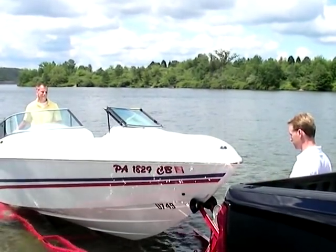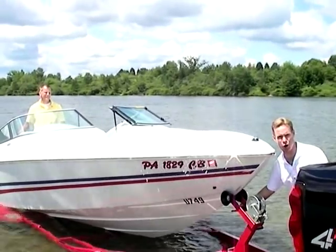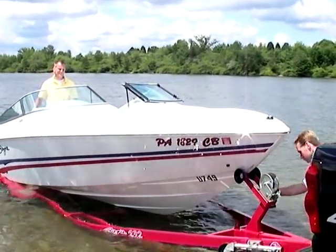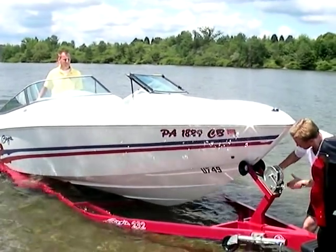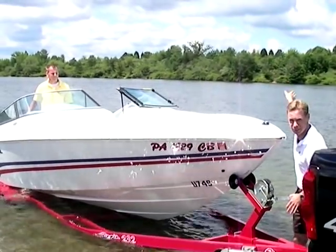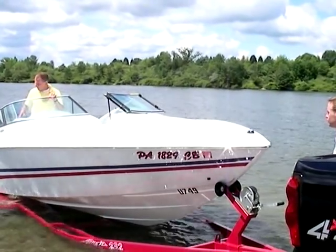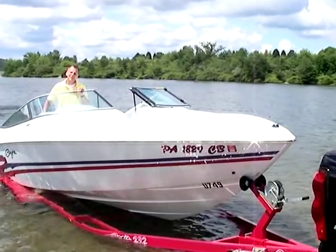Give it a little bit. I've asked him to hold the engine in gear while I flip the winch on. Give it a few turns to make it tight, then tell him to kill the engine. Now I'm going to raise the outdrive so it's all the way up and clear of the ramp, and we'll be all set to go.